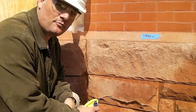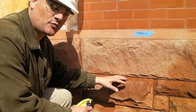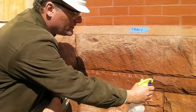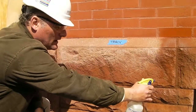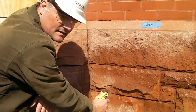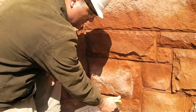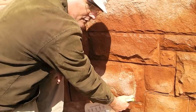This is the final step of the wall preparation. We've now cut back the joints to the joint finish profile. Now we're actually going to be putting on the water and spraying down the joints to keep everything nice and wet as the mortar cures — we want the mortar to cure nice and slowly. You can see how fast this stone is sucking up the water. We want to keep that moisture in the mortar for the first three days after our installation.